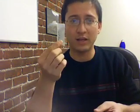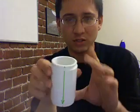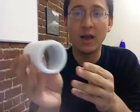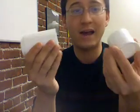So we've provided extra blades for you to do that, and we do use standard box cutter blades, look like this, careful they're sharp, and this is how you're going to go replacing that part of the splitter. So it's really just a few pieces of PVC here, and the end with the blade closer to it will slide right out. You might need to wedge a little screwdriver or something in there between those spots, but most of the time you can just pull it right out like that. So that comes out like that.